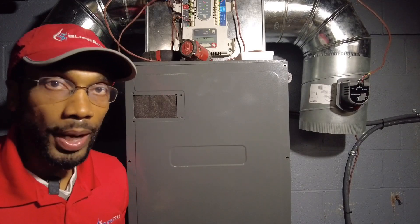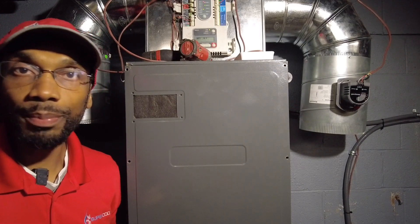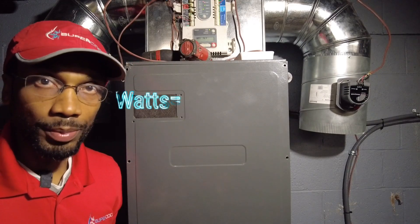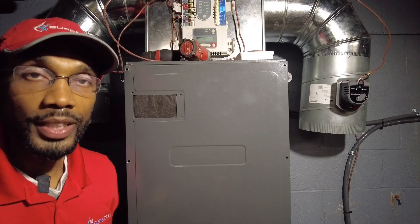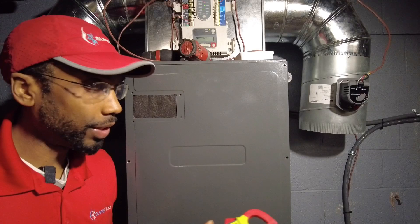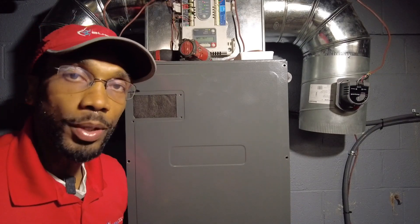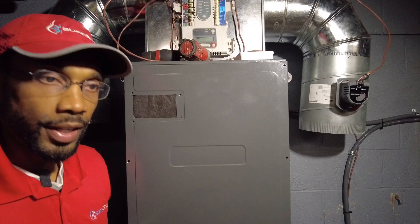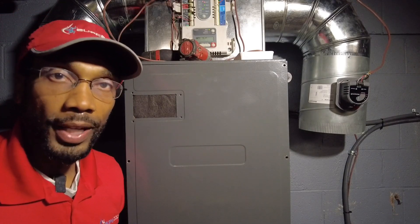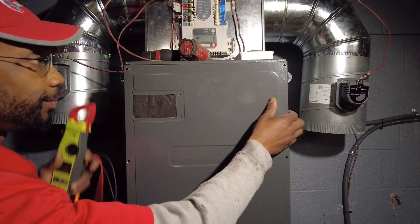The Redfish is comparable for getting down into lower amp draws and reading power factor and calculating wattage. I note that because you want to know true power — the true power the blower motor is pulling. If your blower motor is an ECM variable-speed motor, you might see a power factor between 0.6 and 0.8, so you can't just multiply volts times amps. You'd think power is a lot higher than it actually is. Also, a power factor below 0.95 usually indicates a weak capacitor — above 0.95 and your capacitor is likely strong, with good phase alignment between current and voltage.